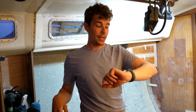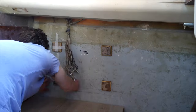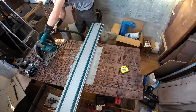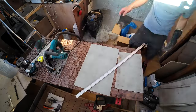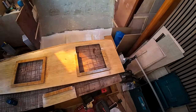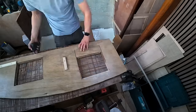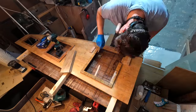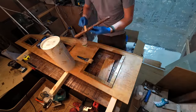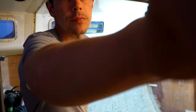We've reached the end of the day — it's actually nearly ten o'clock. I just didn't want to stop as I had a good flow going. I've put some blocks on the starboard side of the hull where the nav area is so I can put a wooden back plate on to screw bus bars and cable runs to. I've trimmed down the fiberglass panels so they're nice and square and ready for the repairs. I've also fixed a very annoying problem under the gimbal stove where the floor hatch was — I'd put it in the wrong place when I didn't know the design. I basically filled that bit in and moved the hatch back a little so we still have access underneath. Really chuffed with that one. I can reinstate the floor tomorrow.